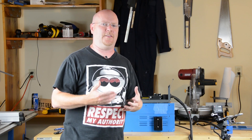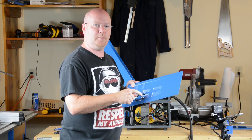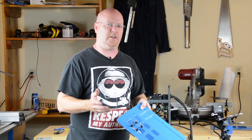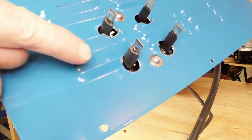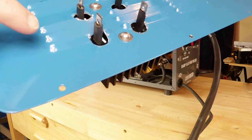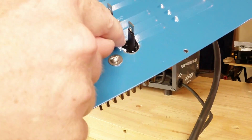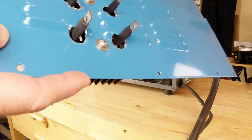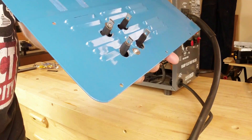After the big oops, we finally got the bridge rectifier mounted. Just a couple of holes drilled — four in the back for the terminals and two more for the mounting hardware. The configuration will depend on your specific rectifier. I put some heat shrink tubing around the contacts and shoved it all the way down to the body, because even though the holes are pretty big, the contacts still come relatively close to the metal frame and I didn't want any short circuit surprises. We're left with holes in the ends of the terminals where we'll attach ring terminals using screws.